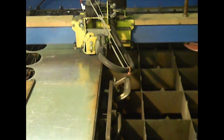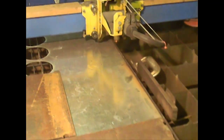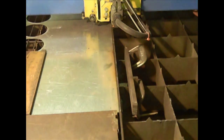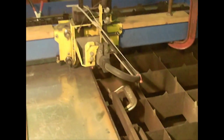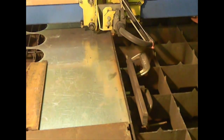This machine is, like I've said on many different occasions, phenomenal. Being able to disconnect it from the computer and use it as a giant miter box or a giant radial arm saw just adds a new dimension to what I can do with it — it just became a more valuable piece of equipment. Being able to cut strips consistently at an inch wide — or half inch, three quarter, it really doesn't matter with this setup. Programming that in the software, you could, but as thin as the material is, if I'm cutting that close together the material's going to warp and bend. And I don't have the digital height control on this system, so the Z-axis has to be programmed — it doesn't have the sensor that allows the torch to move up and down as the material flexes from heat expansion. That's another $1,000 option I just haven't been able to afford yet.